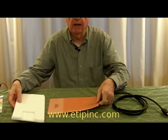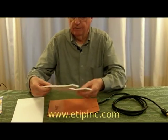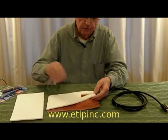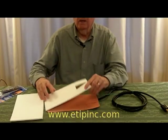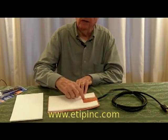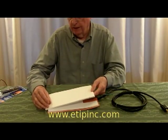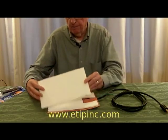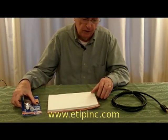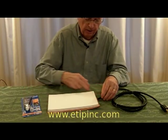When you take one of our heaters and mount it on the housing according to our instructions, then take the insulation with the cutout, dab some of the adhesive sealer in various places, mount it on top of the heater centering it, seal the inner edge of the cutout, then apply the silicone adhesive to the second layer, apply it over the top, and then go ahead and seal the edges of both the heater and the insulation all the way around.